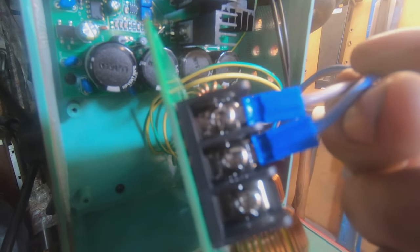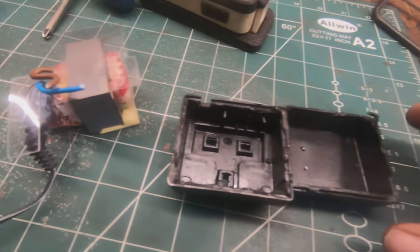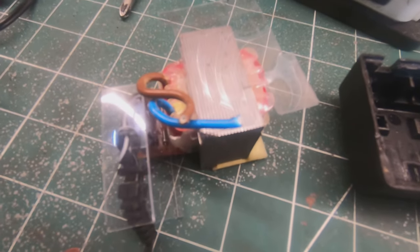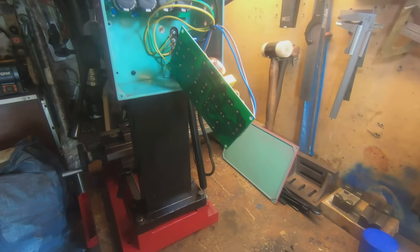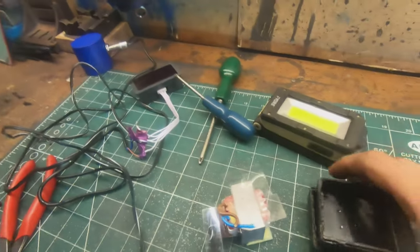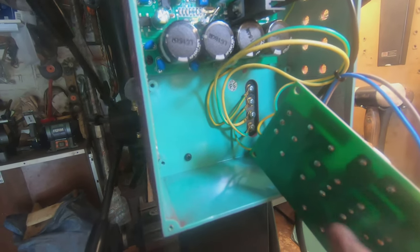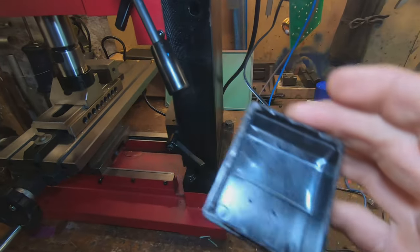The terminals lifted out relatively simply — those are the ones we want to take a spur off. This is the 12V transformer which I've taken out of its casing — you can see the main input wires and here are the output wires. I don't think I'm going to be able to fit that inside this control box, there just isn't room, so what I'm going to do is reuse this casing, probably mount it on the side, and lead a wire straight through to tap in.